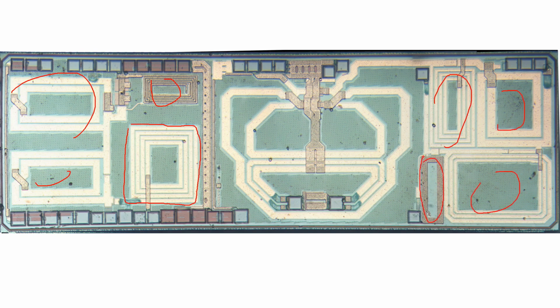And of course, you want to create a high voltage with an inductor. Of course, that's very easy. You put current into it, let the field collapse, and then rectify it. And it's certainly a time-honored way also of creating a high voltage. And then in the center here, my goodness, piece of artwork, isn't it? Almost looks like an impedance matching transformer. So I think there must be a few transistors sitting in this piece of silicon, but I must say this isn't quite what I expected at all.